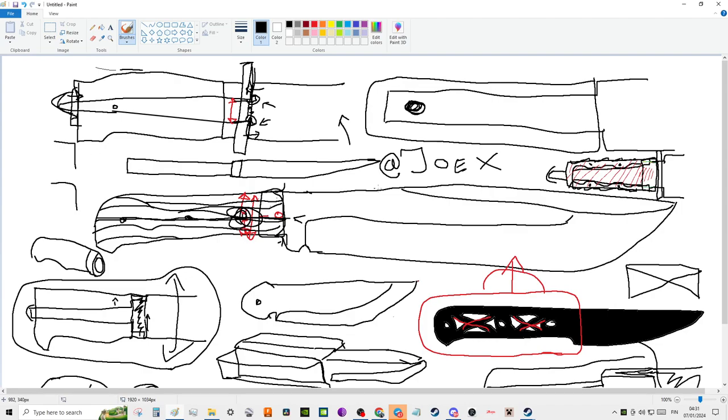where that front pinhole is and where you put it, because you will see an enormous amount of designs out there where they have a fat back end of the rat tail of the full tang. It comes super narrow and comes back down like this, and it's an enormous blade like that, right? And then they put their little pinhole right there. I mean, it's just going to snap right off from here.